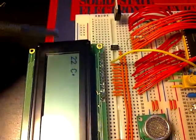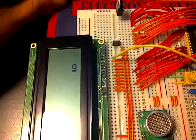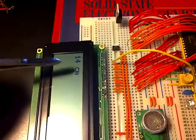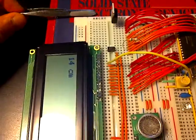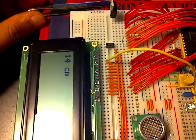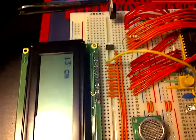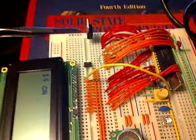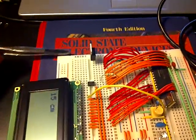which is okay. And so for that reason, I thought it would be a good idea to show the units, centimeters or centigrade, before the number is shown, so that the user feels as if yes, the mode has changed and the number is coming up soon. Otherwise, it would just show nothing, and for a moment, it would give a feeling of something having gone wrong, which really hasn't. It's just, as I said, delay cycles and things have to be completed before it can carry on.